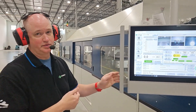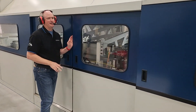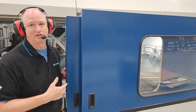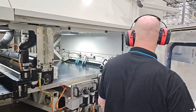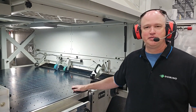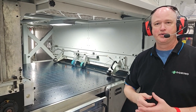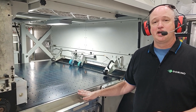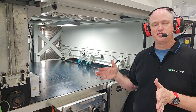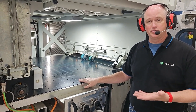Let's take a look inside the machine and see what we've got under the hood. Right here on the front you'll see there are some large sliding panels. The machine is fully enclosed because we have an HVAC system to control temperature and humidity for optimal printing. This is the back side of the feeder. When the sheets come out of the feeder they come onto the main transport belt. This is a vacuum driven belt that holds the sheets down as they transport through. This belt also has servo motors with dampeners, so when the operator sets up the sheet size the dampeners will move into position to optimize the vacuum on the sheet, giving them the most ability to hold those sheets down.